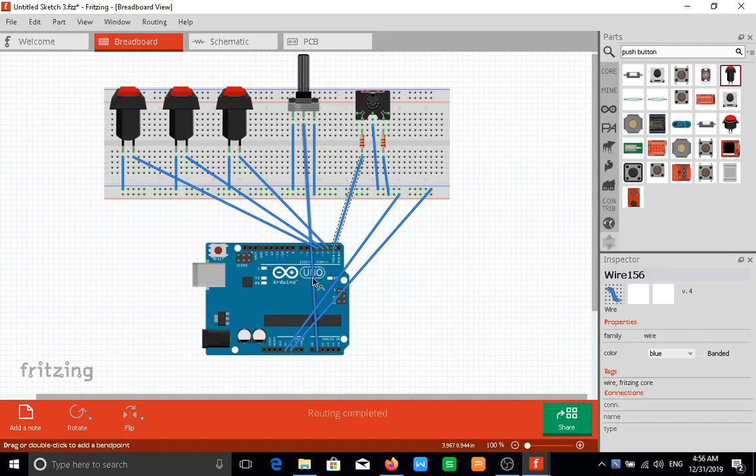Now in a situation where we wanted to receive MIDI, for instance for our draw knobs on our stop console, we would want to receive MIDI messages. So if I was to push a piston, and some LEDs are meant to go off while some come on, that would be receiving messages, and in that case we would be using our RX pin. You can see D0 RX, that is for receiving. But since we are not receiving anything for this circuit, we're just transferring, we're just going to use the TX.